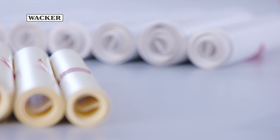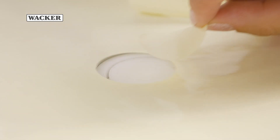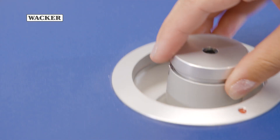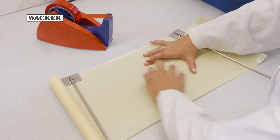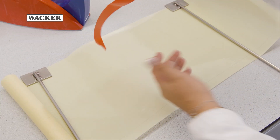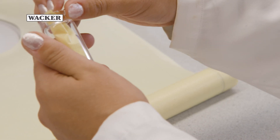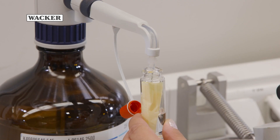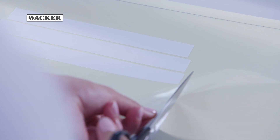Samples for assessing the quality are taken straight after. Four standard tests can be performed on site: measurement of the coating weight; quick manual test for smear, migration and rub off; complete curing — including the preparation of extracts for further testing in a separate laboratory; and preparation for release value determination.